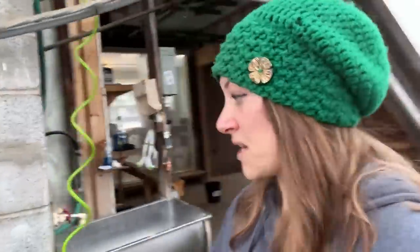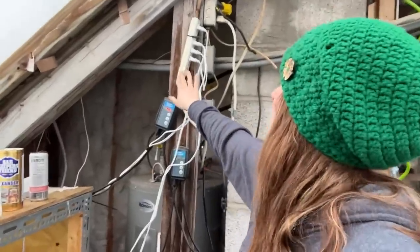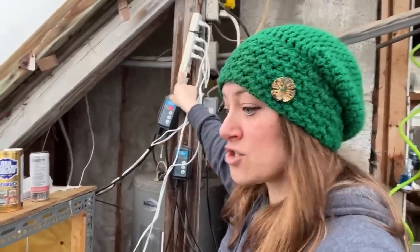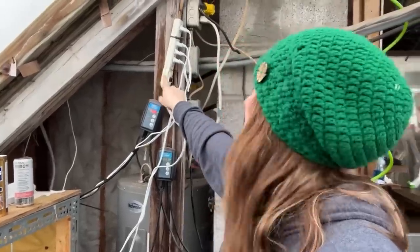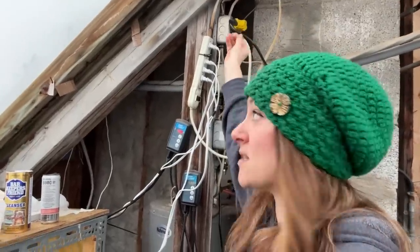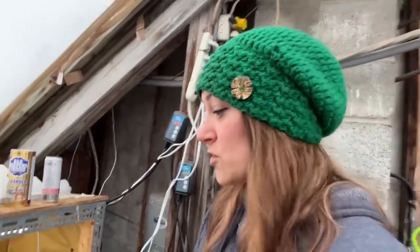This is my germination area. I was a little afraid because it's a bit colder here in the atrium. My father came and fixed the electrical issue — the heat mats were drawing too much power on one strip and tripping the outlet. He got me a little yellow splitter so the heat mats and the lights have to be plugged in separately. The heat mats are all connected, so if one is on, the whole row is on — same with the lights.